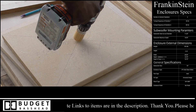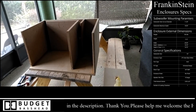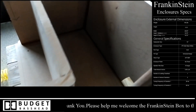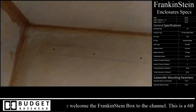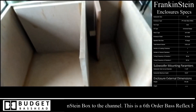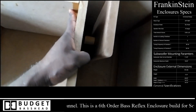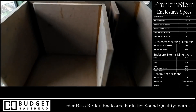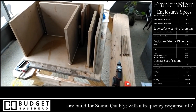Next I'm going to show you guys how convenient pre-assembling your port walls can be. Look at how easy that is — I went ahead and attached that one piece, then glued and screwed this port piece together before putting it in. I pre-drilled holes for all the screws I'll use to attach my port pieces. Glue is really the strength of any box, but throw some nails in certain places too. Some of the woofers I plan to put in this have a lot of force, so I wanted to make sure those ports don't flex or come loose from the base and roof.